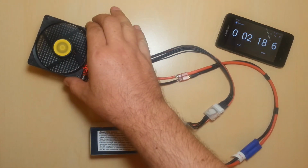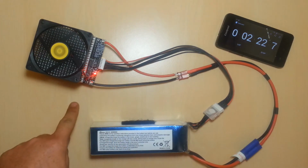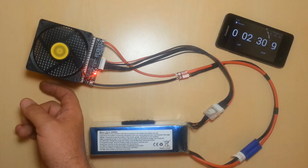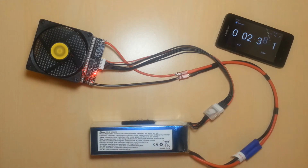There is ample cooling. Another thing I want to make sure of, while we're at the discharger, is to keep the area around it clear and have nothing by it, just as a safety measure. Because of the warm air, we don't want to restrict the airflow. We don't want hot air coming off and going right back in. That definitely defeats the purpose of keeping it cooler.